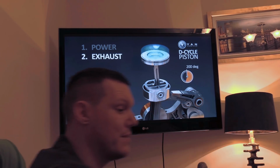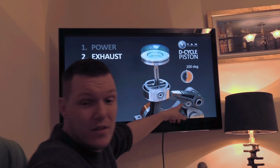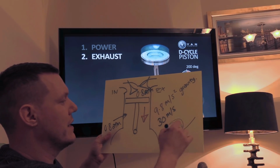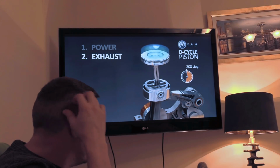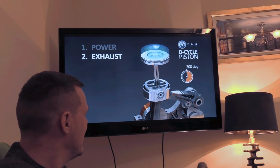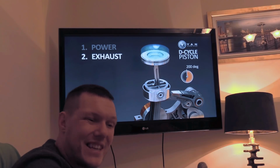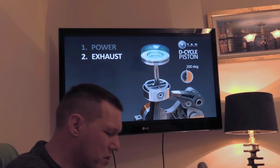Now, that's the thing. What you could do, and probably what's in the system, is in here somewhere, there's a torsional spring, just like the Ducati system, where you have a spring that's like this, just a torsional spring, and that pulls it down. But again, you've now got a heavy mass. It's going to have to be a heavy spring to keep up with these speeds. And you're getting into valve float. And the other thing as well is every time this cam goes against that spring, you're going to have to go against the spring force at pivotal moments, so on and so forth.